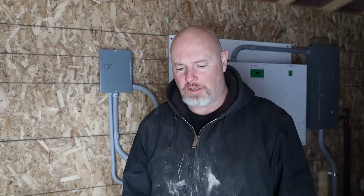Now I have a, if you don't know, it's a regular old ground rod. It's about 8 feet long and 5/8 copper rod, or I think it's copper anyways. I need to pound it down to the ground. So once I get my earth ground on the system, make it safe, once I punch that rod in, we can get to the house.